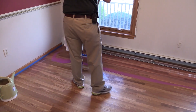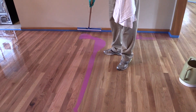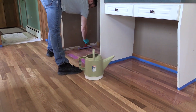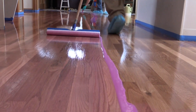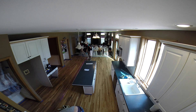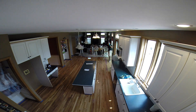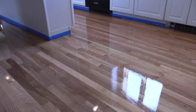Lightforce is applied exactly the same way as commercial catalyzed sealer. We're going to use a snowplow method and a nylon foam applicator. As with the application of the sealer, all windows and doors are shut so there is no airflow. All cut-in areas will meet up with the snowplow and the rest of the room will be pulled with finish. After backing out we close up the doors and wait for the flow and leveling to happen. After about 45 minutes and the finish starts to set up, we open it up to airflow. After approximately three to four hours, depending on your drying conditions, apply the second coat of Lightforce exactly as you did the first.